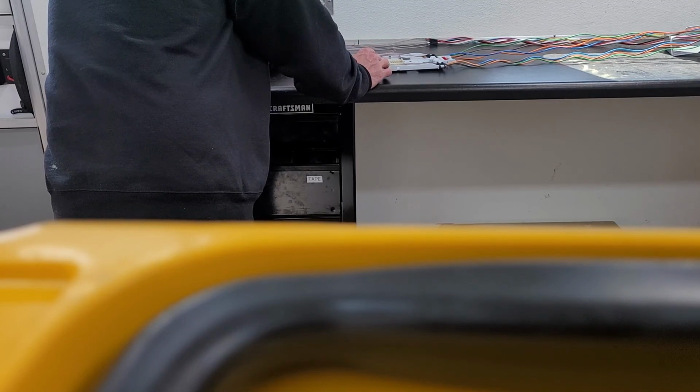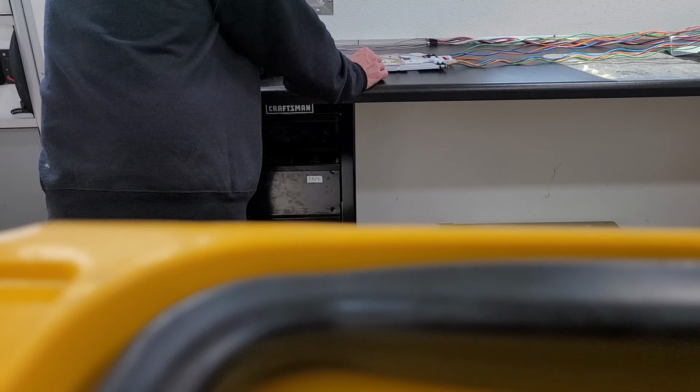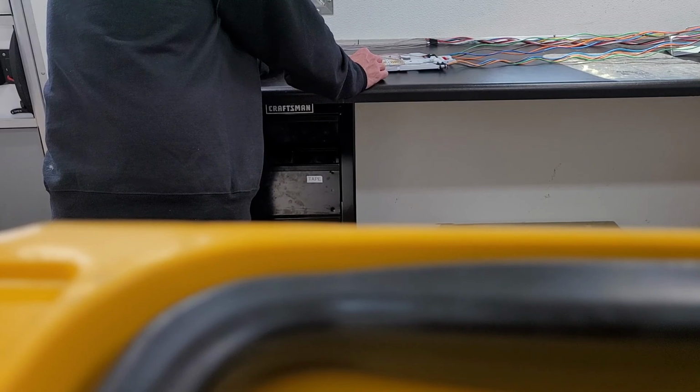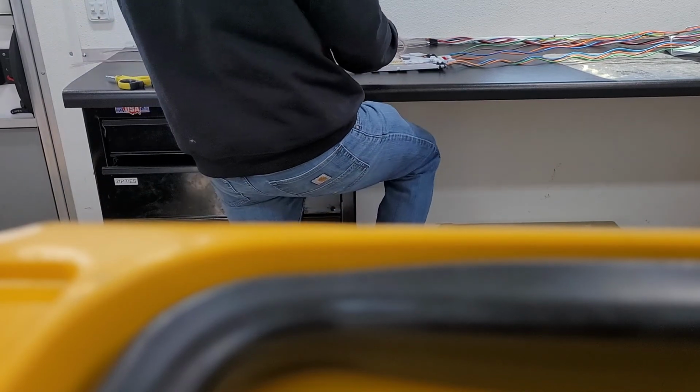If all four tubes are all spliced in all four packs here, and this is the main line, anytime you come in here to change something or splice something, you're going to be splicing to the main line. So say you take two fibers off the main line to splice to, well now you have two open slots in the packs up top from the tube you just broke. So that's why you technically don't need those at the bottom.